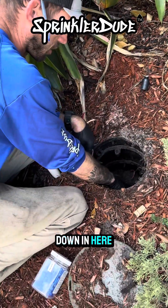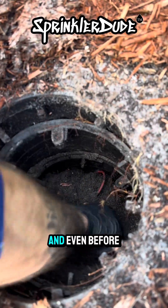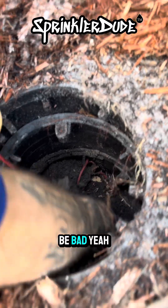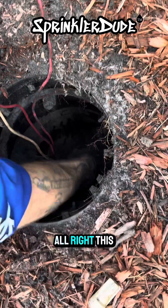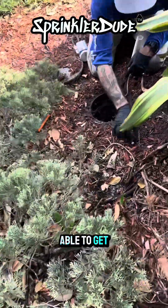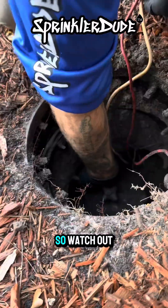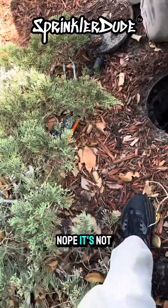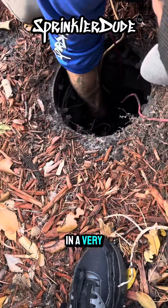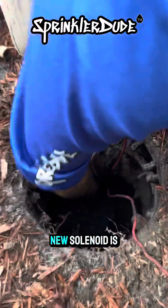First things first, we're going to reach down in here — this is the flow control handle. We're going to close the flow control handle on this valve before we attempt to take the solenoid out. And even before I attempt to take the solenoid out, I'm going to have to spend a little bit of time getting some of this dirt out of here because I don't want any of the dirt to get into the solenoid port. Go ahead and pause the video for a little bit while I clean this out. The solenoid, annoyingly, is not in a spot where I'm going to be able to get to it easily. I close the valve because I'm going to open the solenoid and the zone's going to want to turn on — water's going to want to come out of here. It's not spraying out. Good — it's because we have the flow control closed. And now I've got to carefully screw the solenoid in in a very difficult-to-reach area. But with a lot of experience and patience, this is totally doable. And the new solenoid is in.